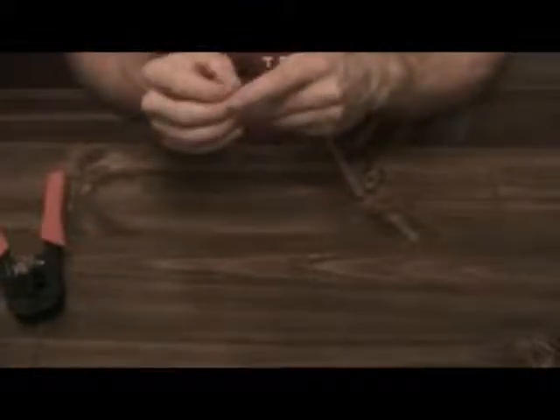Now I'll do the same thing on the other side. Apply a little bit of pressure and rotate. If you apply too much pressure you can cut into the wires — if that happens, just cut off a little more from the end and start over, it's not a big deal. It's usually a good idea when you're first starting out to give yourself extra cable length so if you make a mistake you're not throwing away the whole cable, just cutting the end off and starting over.